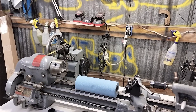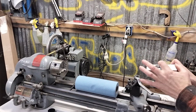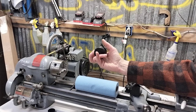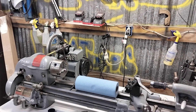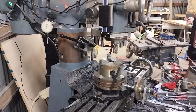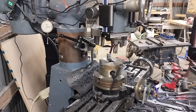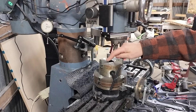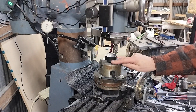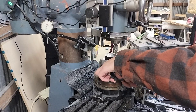So I made these jigs to try to hold the plastic in place, but I've had a lot of problems with lifting. Then while working on the lathe I had the epiphany — what if I just held it in a three-jaw chuck on the milling machine? I realized I've got this rotary table with a little three-jaw chuck. I can use the chuck as my reference surface, put the puck in there, set that depth exactly where it needs to be, and then run the part through.